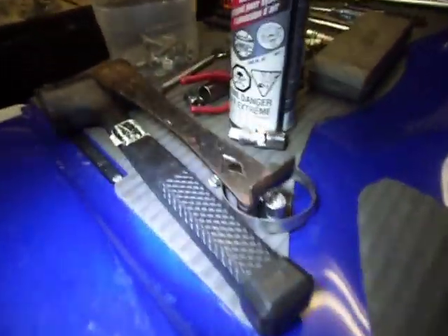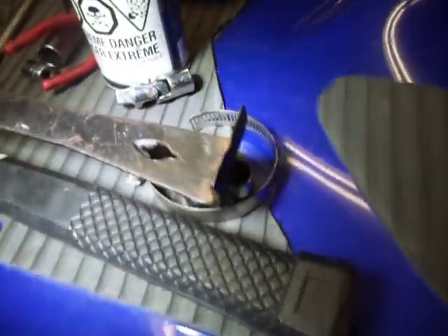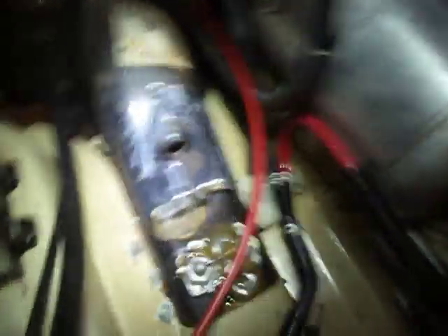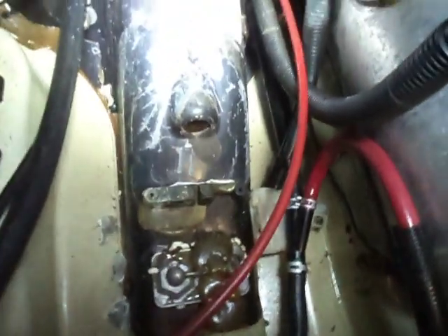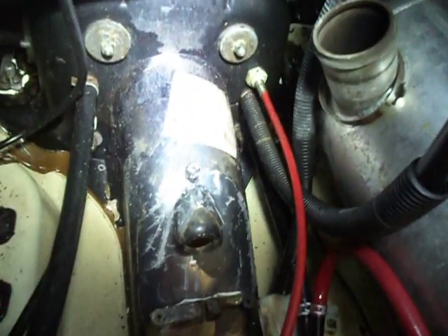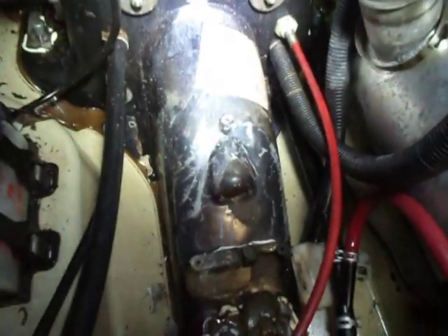Then I had to use a hammer and actually a flooring scraper that I tapped right there — tapped off all the glue. I still have a little bit left to take off down there, and I'm going to sand the shine off that plastic with criss-cross sanding using 120-grit paper to make the glue adhere better.